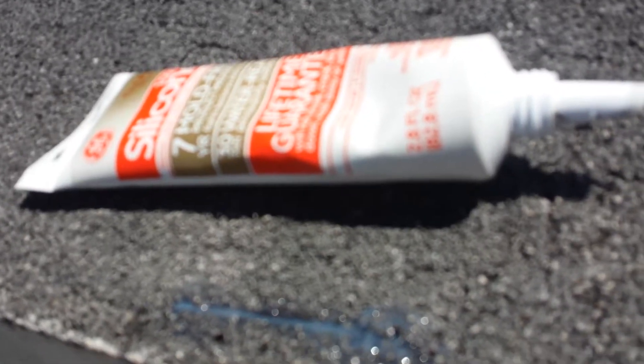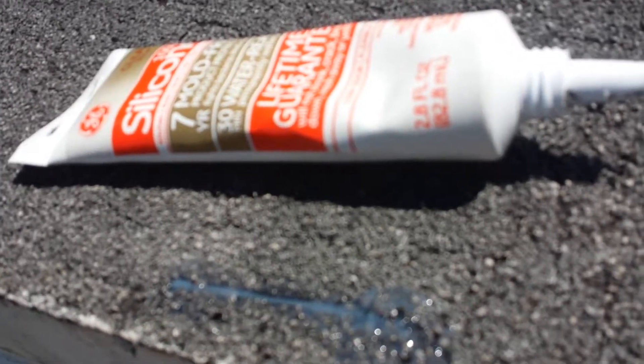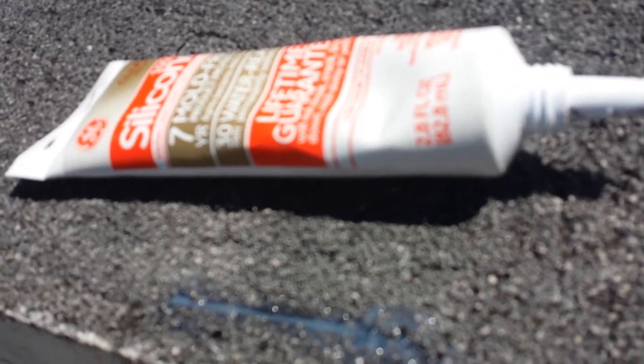So what does that mean? Now my new fascia is going to drip water from about an inch in. How do we fix it? We fix it the old fashioned way — good old fashioned silicone along the slice.